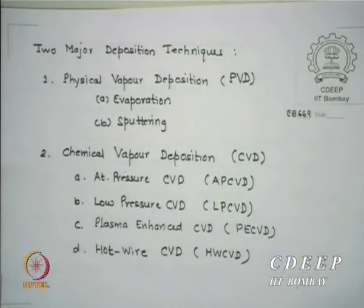CVD normally produces conformal or contoured coverage following steps, whereas sputtering needs special adaptations for conformality. In most ICs we have seen, there are different film thicknesses everywhere, and any deposited film must follow all steps. If it does follow steps, we then need CMP to planarize. These are all process challenges. We will now look into evaporation first, then sputtering.